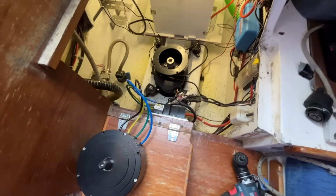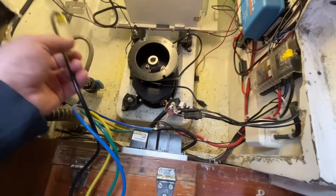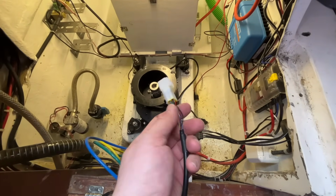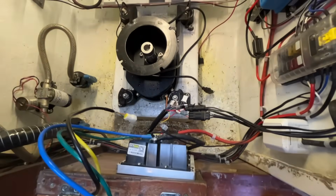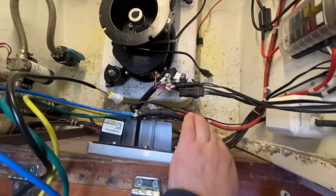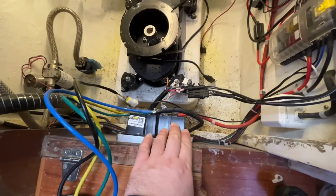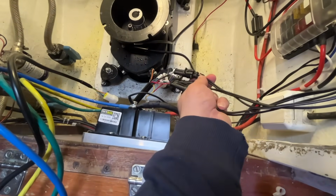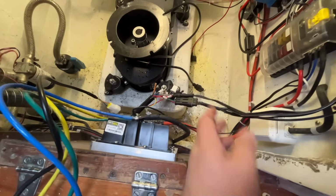A few moments later. All right, now the thing is pretty much connected. There are three phase wires connected to the controller. Oh, I need to connect this. It does the sensors, and there's also actually a temperature sensor in here, in addition to those Hall sensors. And then there is the minus from the battery, the plus from the battery, and a couple of other things. The good thing about this is that the wiring is pretty much the same. So this is the throttle, there's a reverse button, and then there's this ignition key thing that activates the thing.